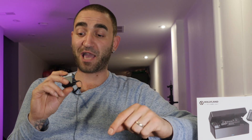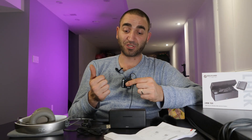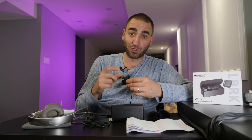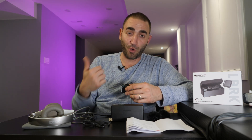Here's a quick audio test with the lavalier microphone mounted on my shirt — the Hollyland Lark 150. I plugged the lav into the transmitter via the 3.5mm port jack. We have a green light and a blue light on the transmitter. Blue light means we are connected to the receiver and communicating — picking up audio. If the blue light is flashing, that means it's not connected and you're dropping audio, so pay attention to that. The green light means you have battery and power. When battery is low on the transmitter, the green turns red. When charging, it turns orange. So: red = battery low, green = battery good, orange = charging.